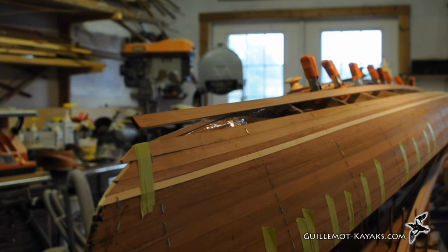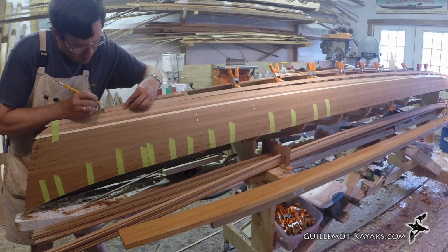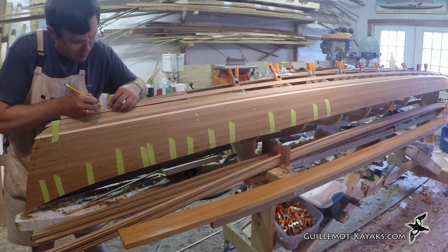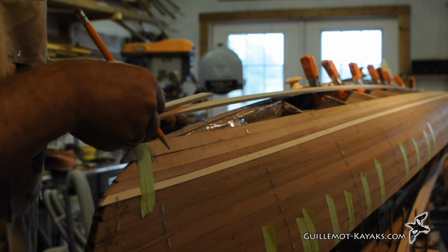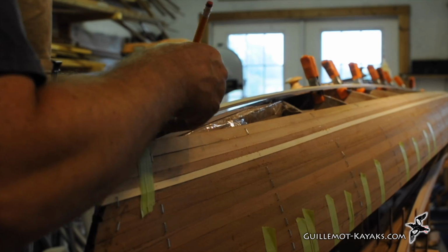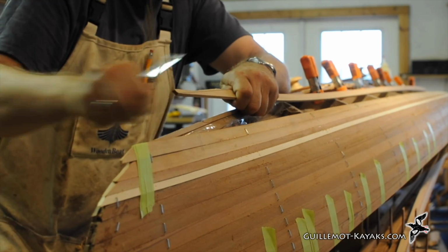Once I've stripped past the knuckle of the stem, I have some more solid reference points to guide the fitting process. I can mark where the new strip hits the keel line by sliding it to the point where it touches. After sliding it back out to the right length, I transfer that mark to the new strip and draw a taper from the mark to the end. I just hack the excess off with a jackknife. It's handy, quick, and efficient.